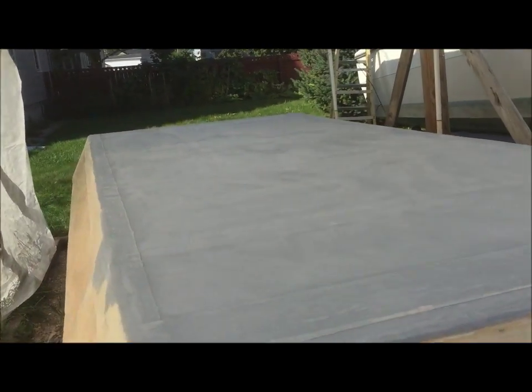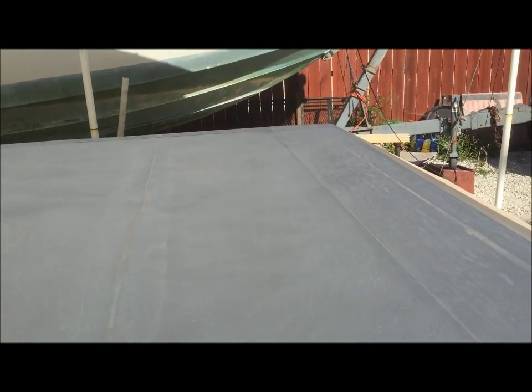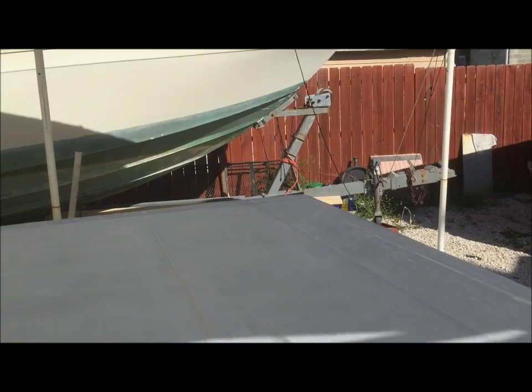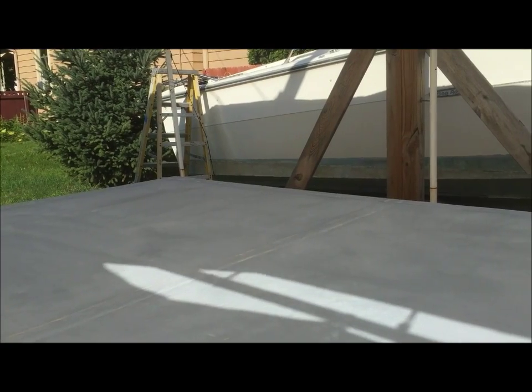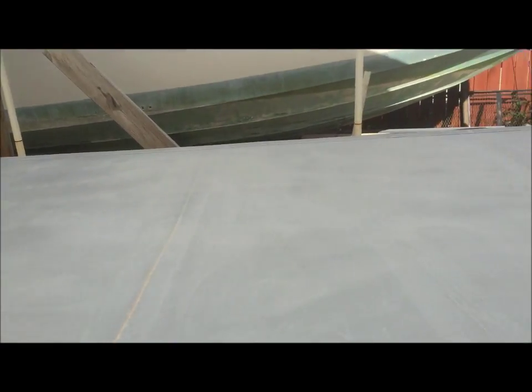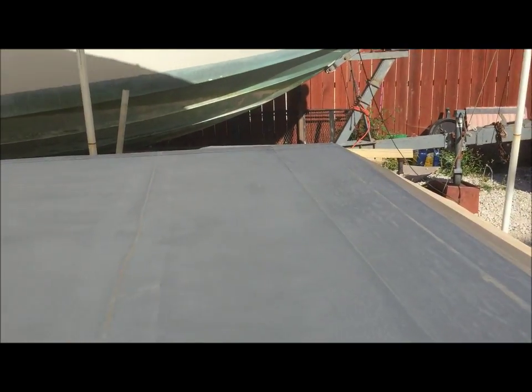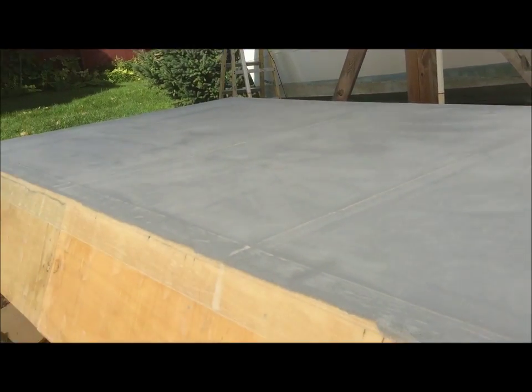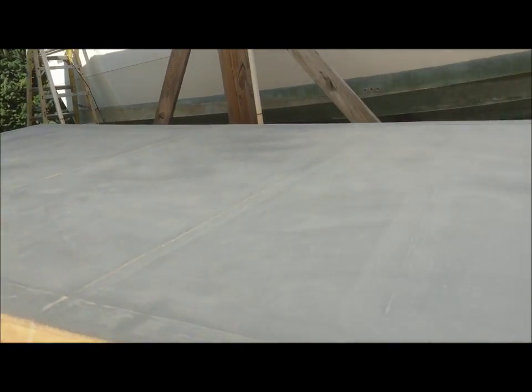The whole outside of the boat has been sanded. I rolled on the first layer of primer, which wasn't the greatest idea — especially unthinned — so it didn't come out great. I sanded it back down, went out and got some thinner for it, and picked up a cheap spray gun so I don't plug up my good spray gun. When the wind dies down in a couple of hours, we'll shoot it with a full coating of primer over the entire outside, maybe even get a second coat on right away, and then tomorrow we'll look at shooting it with paint. We're about half a day behind where I was planning, but it's not too bad.